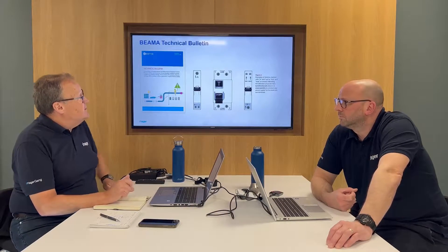Basically, you have to be clear: look for devices that are either marked or not marked. You can see these devices here — clearly marked with 'line' and 'load', or on the one on the right, with arrows as well. These indicate the direction of power flow, and if they indicate direction, you have to respect that power flow.